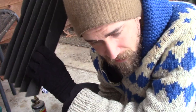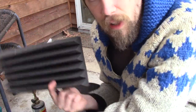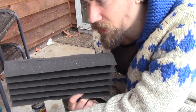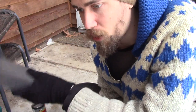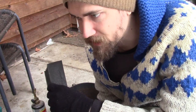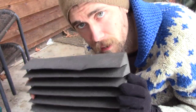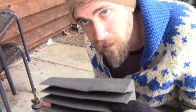The problem with cheap foam is it's very, very flammable. Auralex, or any reputable studio foam maker, they're actually thicker and tuned more for audio. And always, always check that they are what is called Class A fire rated. That's a building code thing — if you want to hang these up and still be up to code, they have to be Class A fire rated, which means they will not burn even if you take a torch to them. And I'm going to attempt to do that.